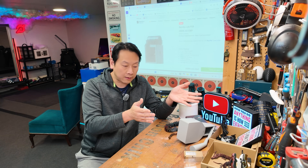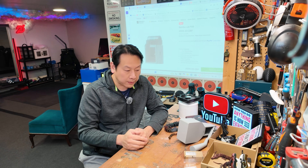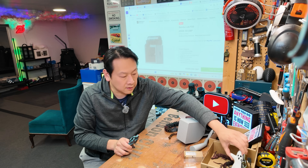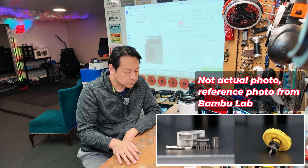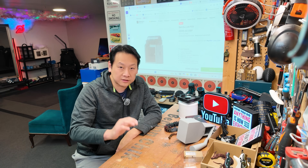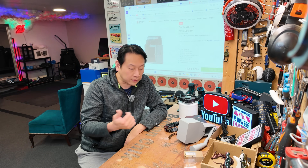I have three BambuLab filaments that I bought — I bought four but put three in — and one roll of a rainbow color non-BambuLab filament, like this one here. This white and black one is the BambuLab filament. No matter what I tried, it just didn't work. I followed the instructions, cleaned the extruder, tried doing a hot pull and cold pull on the nozzle — it still didn't work. Luckily I had bought a couple of extra nozzles at the beginning: a 0.2mm and a 0.4mm, so I started printing with the 0.2mm.